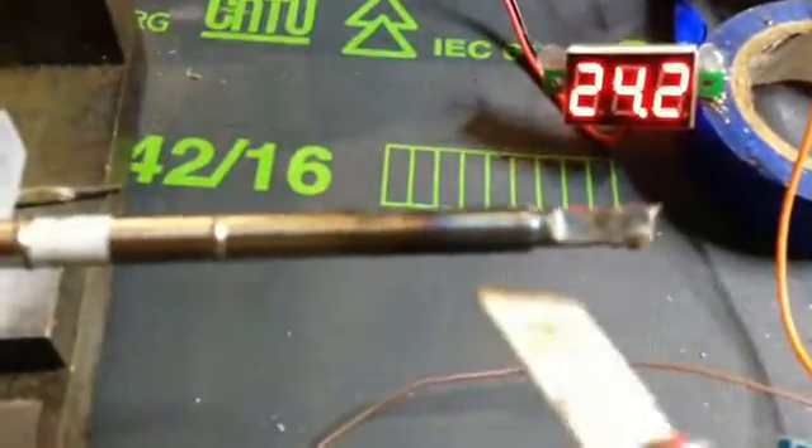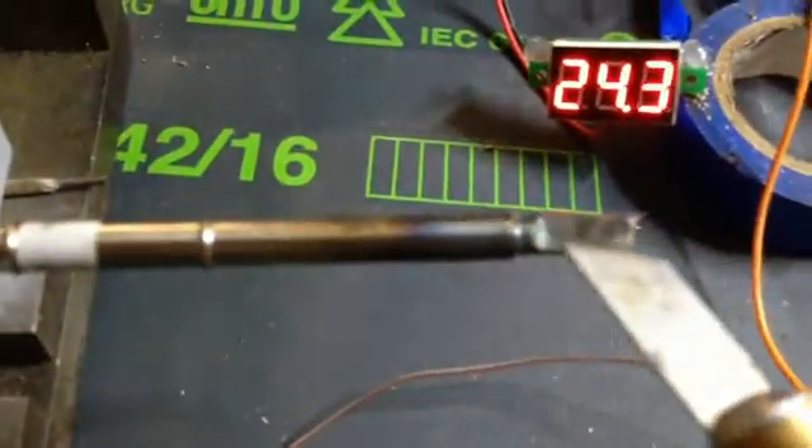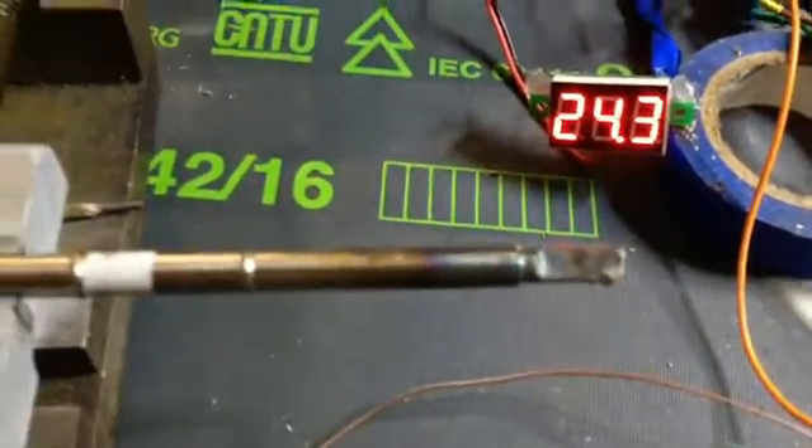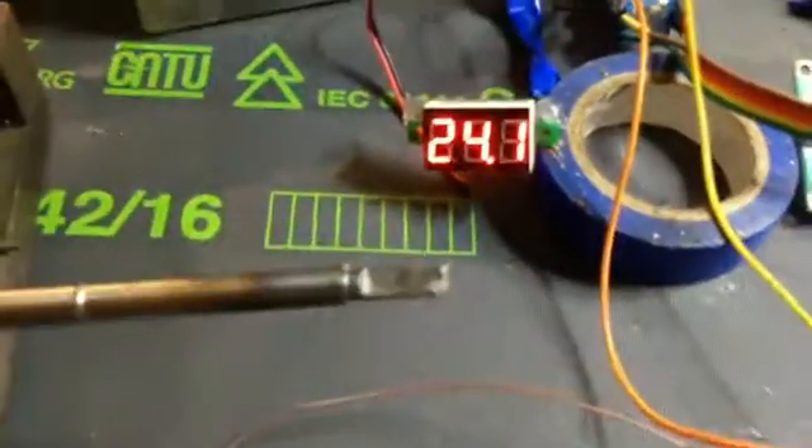What you need to know is that the chip has polarity — that's very important. This chip does not have a special separate connector for heating and sensing, because the heating element is included in the heating sensor. You have only two wires. This is very important to know; it is very rare to find a chip that works like this.